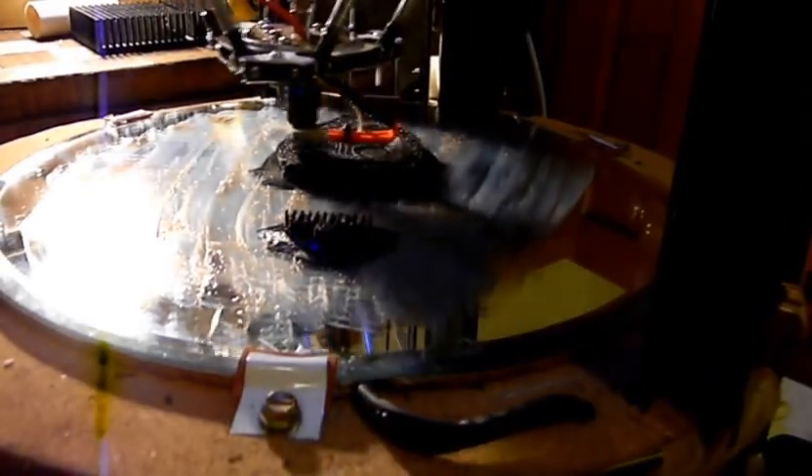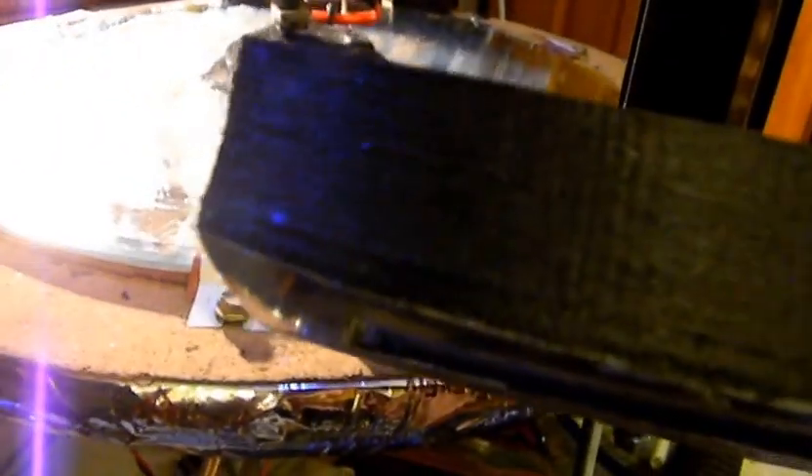It's a pretty big object - one of the biggest I've ever printed. But this previous one came out pretty bad. Notice the warping. There's no heat spreader on the table so it's not heating up evenly - over here there's almost no heat, so this thing lifted up and it looks like crap. Plus there's no heated chamber.